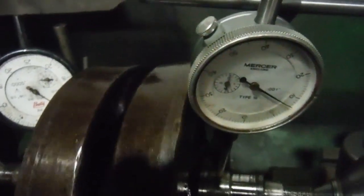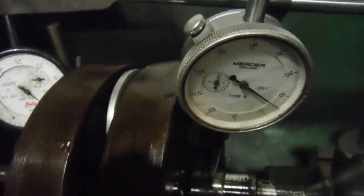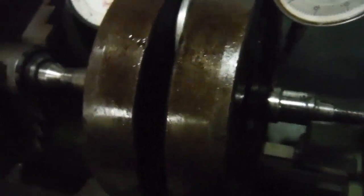Unfortunately the surface of it has got rather pitted — you can actually see rusty imprints of the bearing rollers there. Hopefully the camera will pick that up; if not, you might have to take my word for it. You can actually see the needle of the dial gauge flickering a little bit as it goes over the pits. That's really going to have to be changed, unless I can come up with some sort of needle race with an inner race that will slip over that to replace it — I'll look into that.